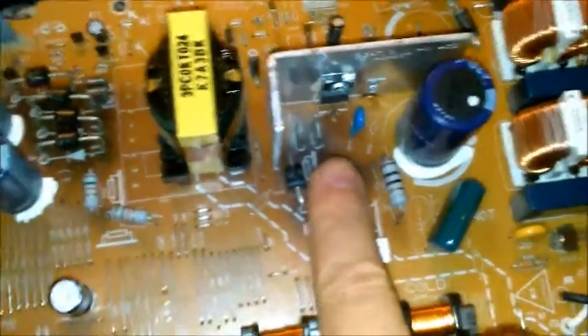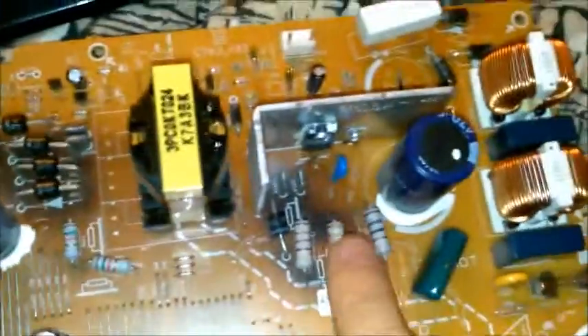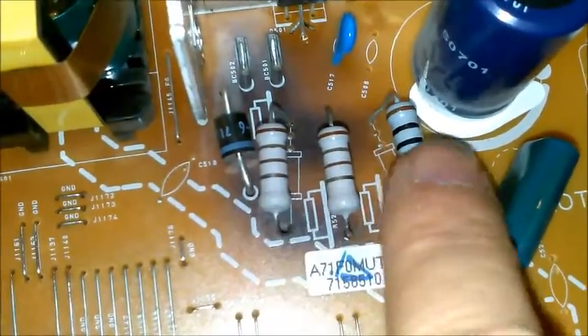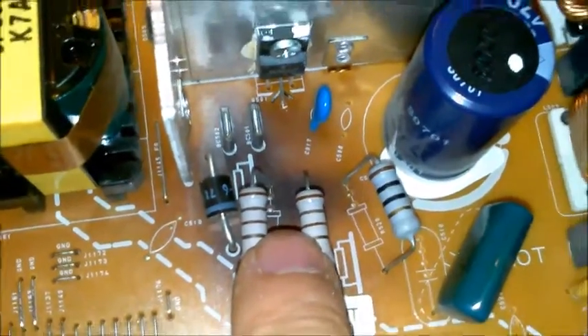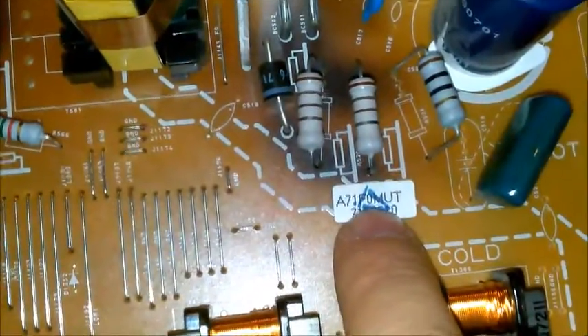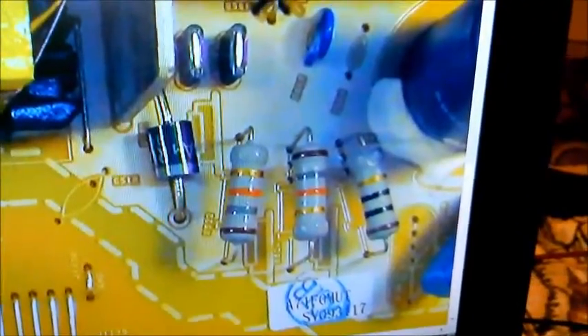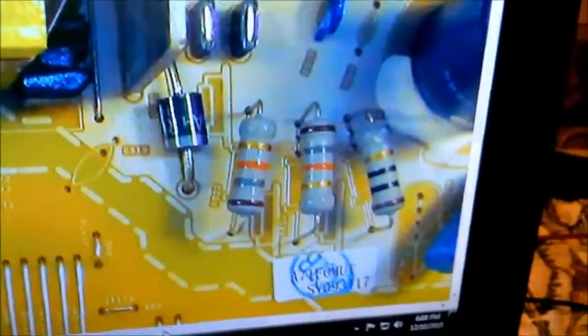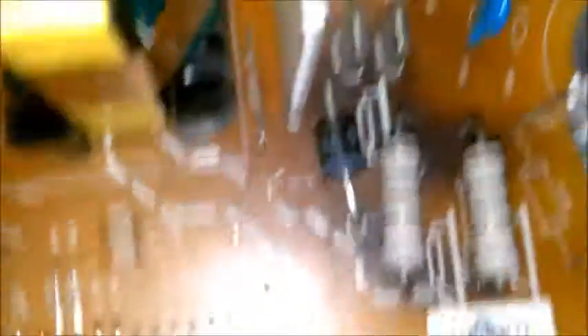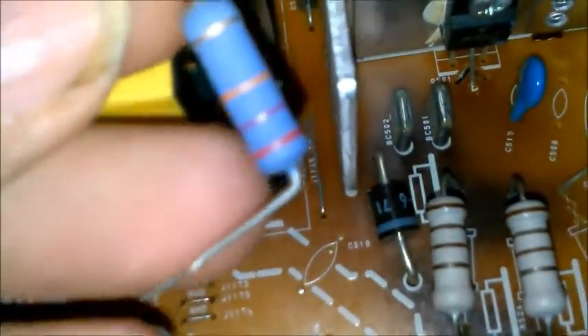There it is. You can obviously see how these diodes get warm too, but they all check good. That's not the color that's supposed to be here - this one's good. I've got an image of the board; this is the A71F0. Here's what it's supposed to look like: those are 18k resistors, and then you've got a brown-black-black - something of the sorts - which is a 10 ohm resistor. I don't have 18ks, but I do have some 21ks, so we're going to throw those in and it should work.